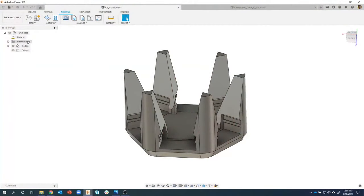When I was doing some testing I ran into a problem - when I would print it would print in the corner really tiny and small. What I found out is my units were set to inches. Once I changed them to millimeters it printed the correct size, so just a heads up. It might be the post processor doing that, so be aware - if you go to print and it doesn't seem to be working, check your units and maybe change them to millimeters. I'm going to do that first - my units are in inches, I'm going to change that to millimeter and say okay.